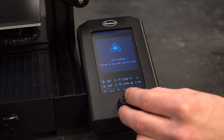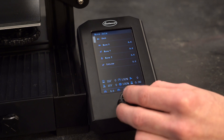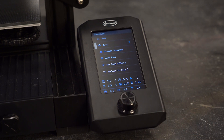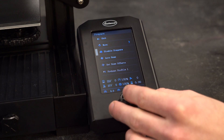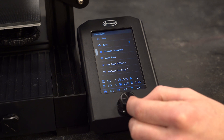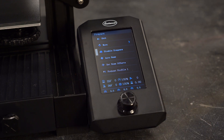If not zeroed, it will auto zero, and then you can set the position of each axis by clicking it and scrolling to the position in millimeters that you want. The second option is disable steppers — clicking it will unlock the stepper motors so you can move the axes by hand. Never force the axes to move before disabling the steppers, as that could cause damage to the printer.